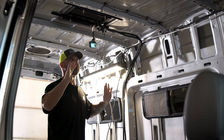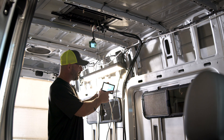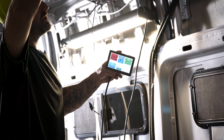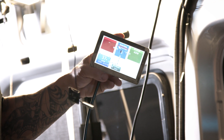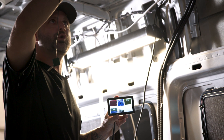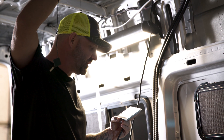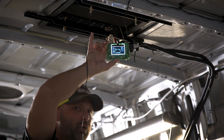Right now the air conditioner is running. The batteries are pretty low but we're using 800 watts — 65 amps, 824 watts. We have cold air coming out of the air conditioner. We just turned it on: it's 77 degrees in here and it's already outputting 53 degrees from the air conditioner. That number will slowly continue to decrease as the air conditioner increases its efficiency. Right now we're still using 62 amps, 790 watts, and the air temperature coming out of the air conditioner is at 45 degrees.